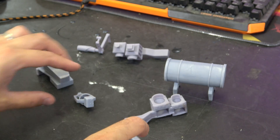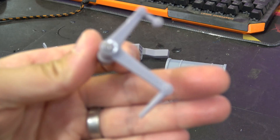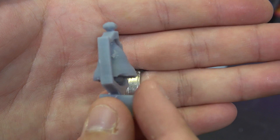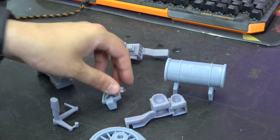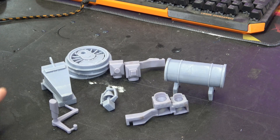That's really important when you're talking entry-level dental and jewelry casting — accuracy and repeatability are absolutely key. These came out really nicely. We've got some smaller, more detailed parts: this here is part of the train's drive linkage, and this here is the little bell. It has done a fantastic job printing all of these parts. They were done in various orientations so they would print as well as possible with minimal supports. There's a little bit of support work that needs to go on, but that's Chitubox, not the actual printer — I just need to adjust my settings for that.